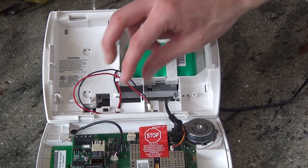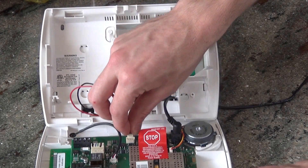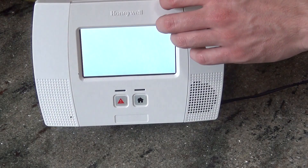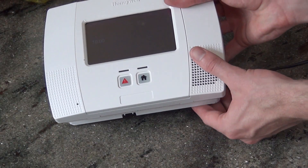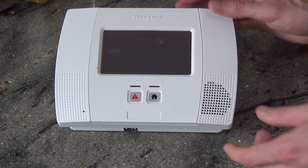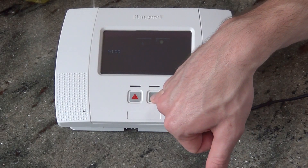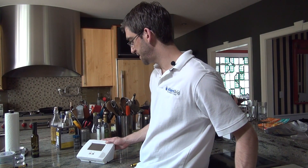We're ready to go. We apply our AC power by plugging in our LT cable, then plug in our battery connection for DC backup power, and we close the panel up. We allow it to go through its boot sequence — it will start red in system standby. We can force it over to green ready-to-arm by pressing and holding the home button. And now the system is ready to go.